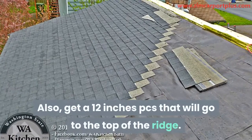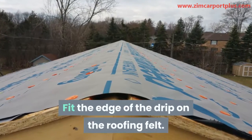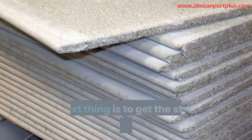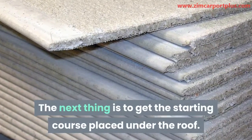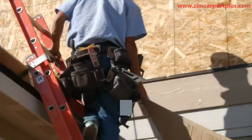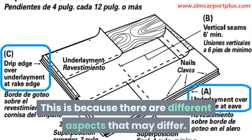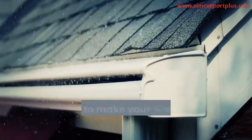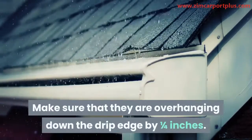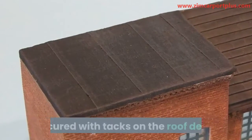To give your work a professional look and prevent any future issues, work with care and attention. Get the roofing of your shed covered with a roofing felt. Make sure they are overlapping each other at the strips by a minimum of 2 inches. Get the tar paper secured on the plywood with a roofing staple. Also, get a 12-inch piece that will go to the top of the ridge. Fit the edge of the drip on the roofing felt, while the drip edges below should be fitted under the roof felt. Get the starting course placed under the roof before the asphalt shingles are installed. Always follow the manufacturer's instructions before you start the installation, as there are different aspects that may differ. Finally, to make your work look neat, check the shingles — make sure that they are overhanging down the drip edge by one quarter of an inch. The asphalt shingles should be secured with tacks on the roof deck.